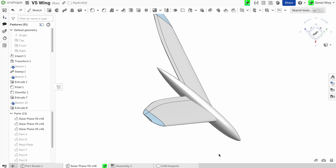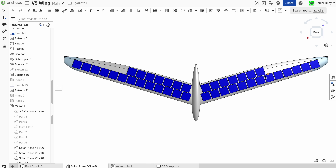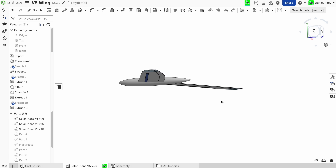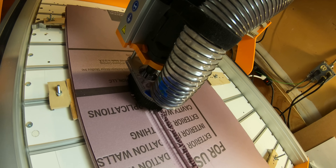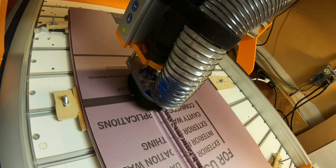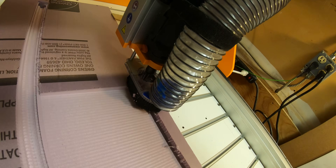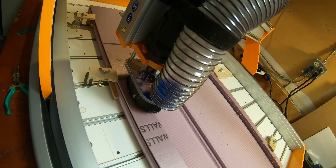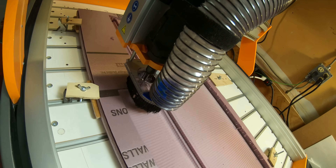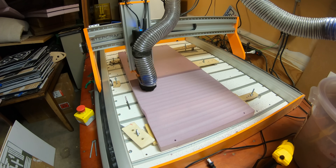The V5 has long, narrow wings for high aerodynamic efficiency. The 3.8 meter wing could hold a total of 40 solar cells. My plan was to CNC machine the wings out of XPS insulation foam and then laminate the solar cells onto the top. After generating all the toolpaths, I fired up the old CNC machine and got to work. The usable Y-axis range of this machine is only about 900 millimeters, so to cut the 3.8 meter wing I had to split it up into six sections. These are all two-sided milling operations, complete with a channel for the spar — so this was several days of work just to make the wing cores.